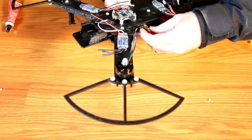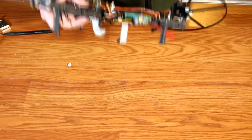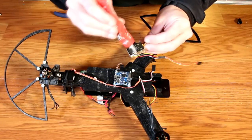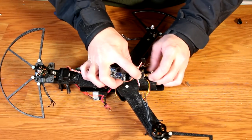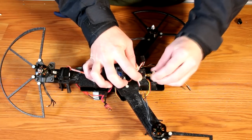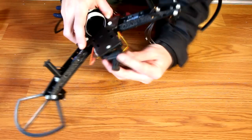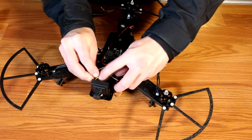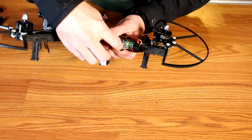The best place I have found for the receiver is on the base plate right up against the rear arm. I mounted my power link board and connections right next to the receiver. I also used a JST as a quick disconnect between the video system and the main power bus. For the video transmitter, I simply glued it to the top of the frame right in front of the flight controller — the camera will go right in front of this. Small video transmitters give enough room for themselves as well as a camera on this frame without any issue. I'm mounting a camera to the front of the vehicle with a small nylon bolt — this should be strong enough to hold it in place, but in a crash it will break free without any problems. I'm running all of the wires through the middle of the frame to keep them hidden and out of view. The wires are run through the frame and back to my power link board, which will control the video system.